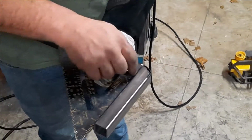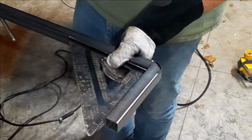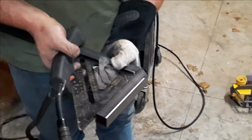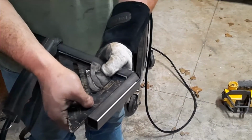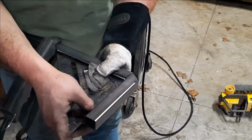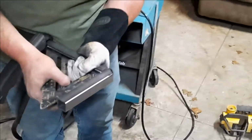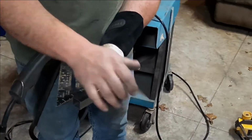That's why you just tack. It was a little twisted and ended up breaking that tack to straighten it out. But I want these to be right, because if they're not right, then when I make the fit up over there on the trailer, the joints are going to look a little twisted and goofy, and I just don't want that.